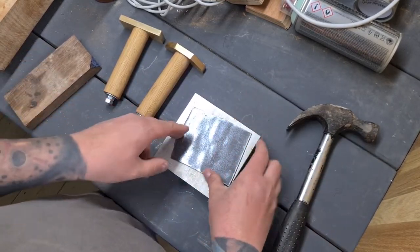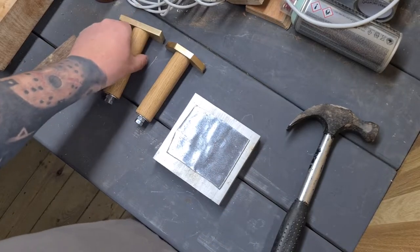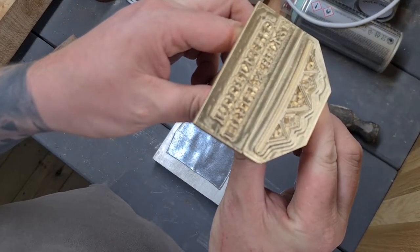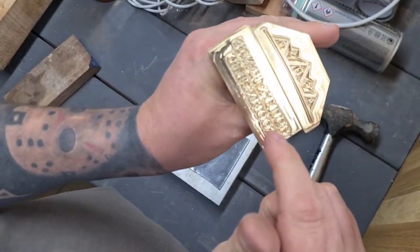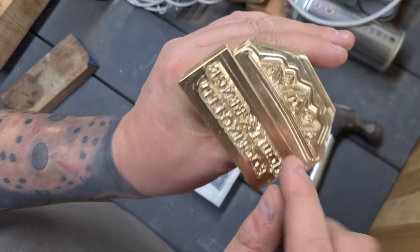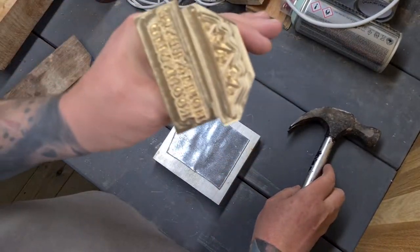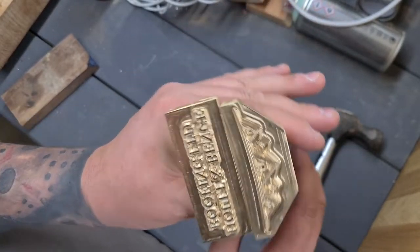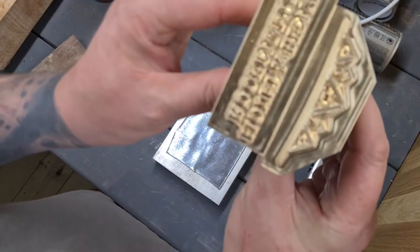Make sure that's nice and flat — there, that's pretty nice and flat now. This is a two-part stamp. It's a big logo, and rather than trying to produce it in one stamp, I've split it into two. The reason is that the greater the surface area of the logo, the more tonnage needed to create the impression on the lead. If you've got really big flat areas, you won't be able to produce that with a hammer — you'd need a fly press or hydraulic press to get 20 to 30 tons of pressure. The less surface area you need to stamp, the easier it'll be and the better the impression.